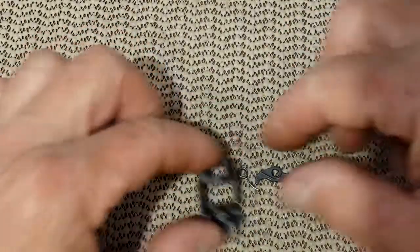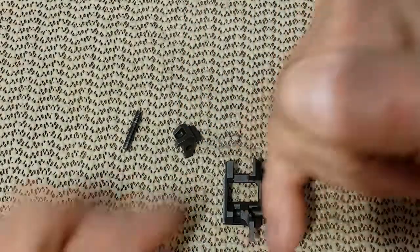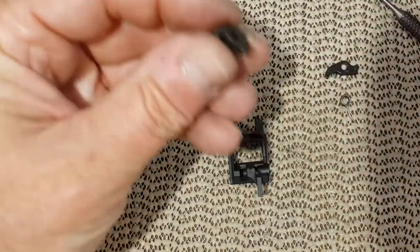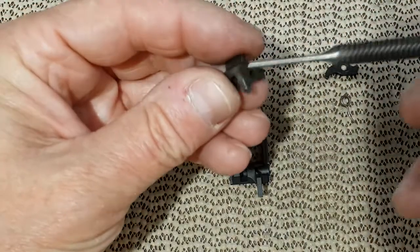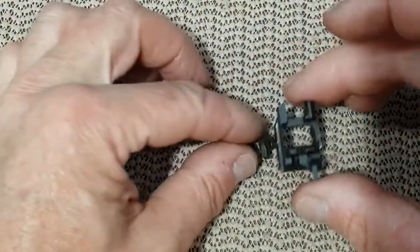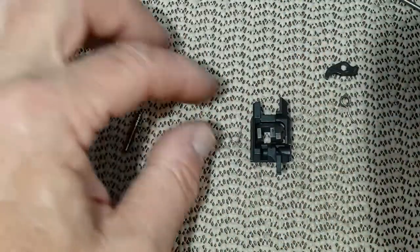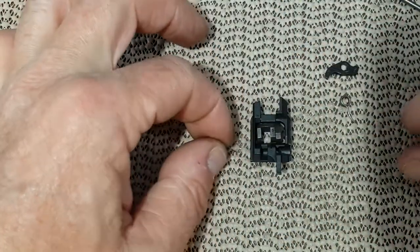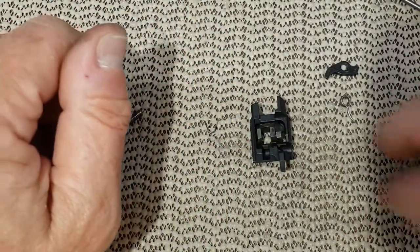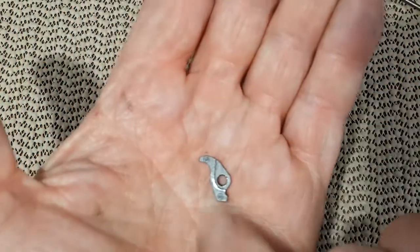Now I'm going to show you how to put it back together facing forward — that's the front of the gun — and that is the ejector here. You want that sear, you see that part here, pointing forward, and you are going to sit the ejector on top of it as such. A little advice: when you work on something you've never worked on before, take pictures with your cell phone as you go along. It helps when you have a question.